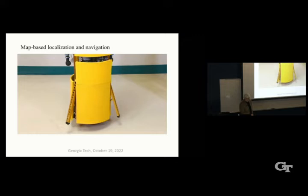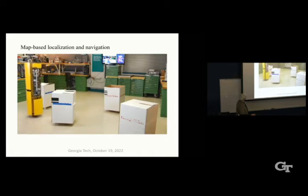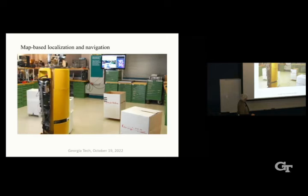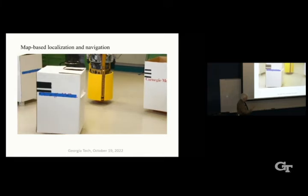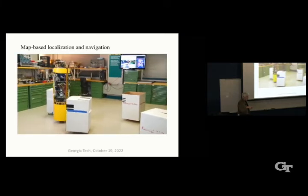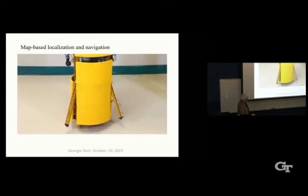So in this movie, it shows the actual robot in the lab, brings up the legs, transitioning between statically stable state and dynamically stable state automatically, and now it's navigating. There's a LIDAR here that's seeing these cardboard boxes, and it's, I think, acceptably smooth motion, and it's also very quiet, although I don't have a soundtrack here on this video, because it's just these rollers turning in a sphere. There's no gear motors and things like that, and no backlash. So it can creep up on you, basically.